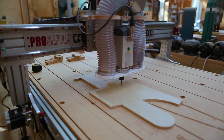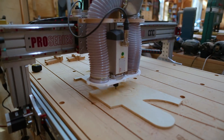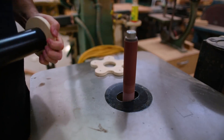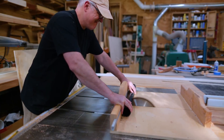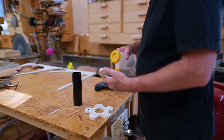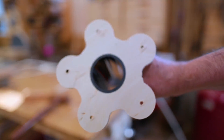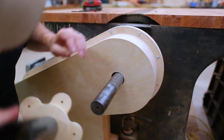Then I need to make a little attachment for a piece of plastic pipe to go over the shaft that sticks out. Probably the biggest question I've gotten from people watching this project is why I don't cut the long shaft off the drum of the drum sander. I really don't want to modify the antique machine — I'd rather build with what I have. I don't know whether in the future I'll need that or whether someone else will need that extra bit of shaft. So I made a little flange that'll hold a piece of plastic pipe. The connection between the flange and the pipe is just friction — no glue. Then I figured out exactly where that should go, traced it onto the cover, and mounted it.